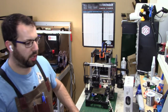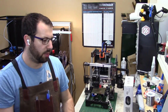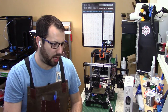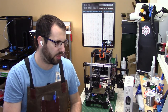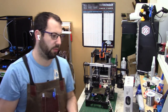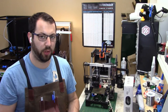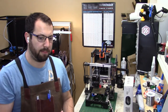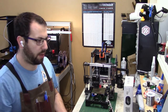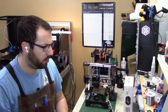So anyways, long story short, people were running OctoPrint to talk to Klipper. And it works. The problem with OctoPrint is it is kind of bloated, okay? Some people don't have an issue with that. And the problem is, though, you need a Raspberry Pi 3 or better. With Mainsail or Fluidd, it's very lightweight. You're not rendering the whole website on the Raspberry Pi. It's acting like a traditional website. The people who know more about the back end can elaborate more.